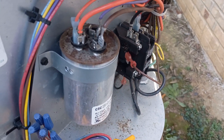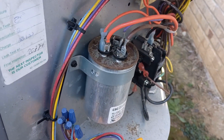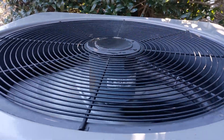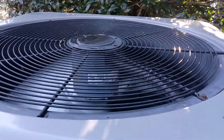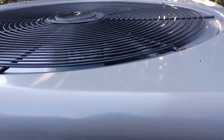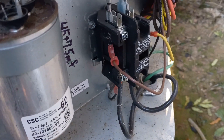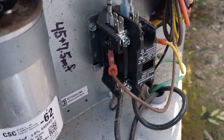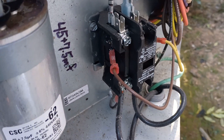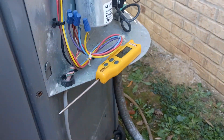Ideally when it does it on its own, that contactor is going to stay disengaged a little longer, give those pressures time to come down and equalize, it's going to shift, heat up, the fan's going to be off, then it's going to come back on and do the same thing again - break the contactor, stay disengaged, let that refrigerant settle back down. Then when it pulls the contactor back in, your fan's going to come on, you'll energize back into heat mode, and ideally that shift should be quite a bit quieter.